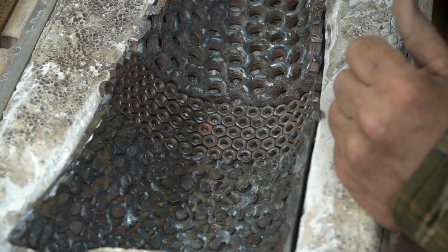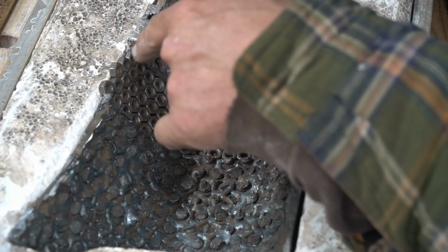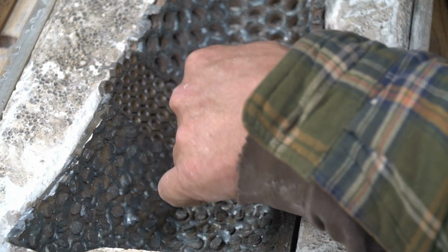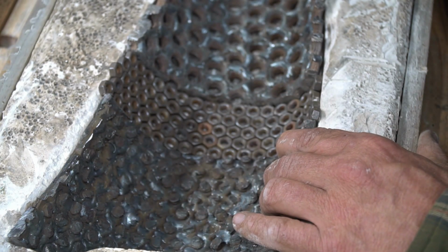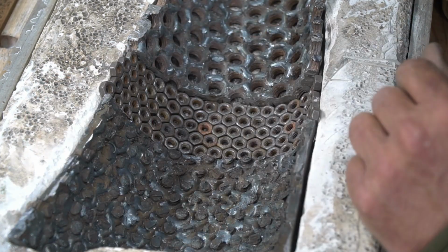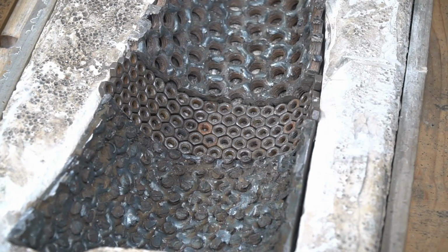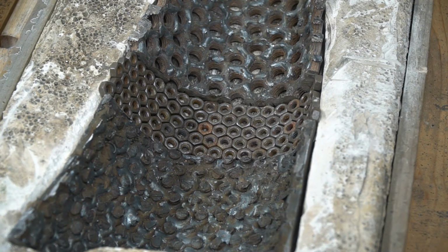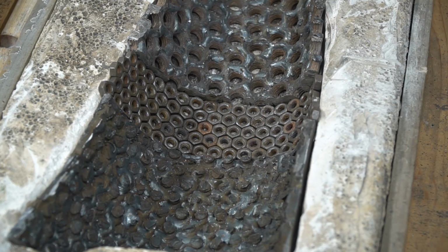I have to show you once it's done, but on this edge and on this edge, it's warped in or pulled in just a little bit. So I'm going to weld everything, but the center right here, I'm gonna weld the centers in real good, maybe force one side over, and then use a hammer to beat it in. This side here is looking pretty good. It could be a little bit tighter. I'm gonna put a clamp on it just to hold it down in. But yeah, I can manipulate all these in once this is welded.